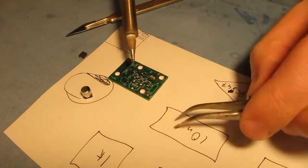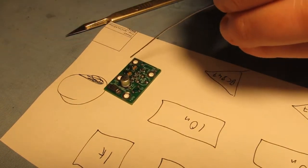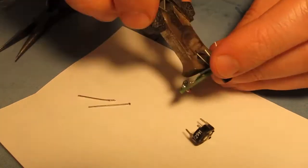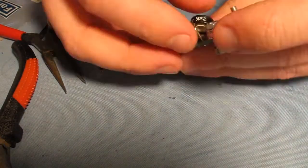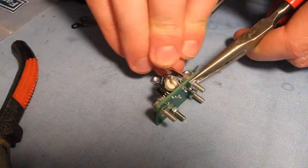Anyway, let's get these stuffed and see if they work. I like to make myself a kit of parts and place them on a drawing or printout of the board layout — it just makes life a bit simpler, at least for the surface mount parts. There's not too many through-hole parts on these, and they need some screw terminals so you can attach wires and hook them up to the system, because the clocks all use screw binding posts.